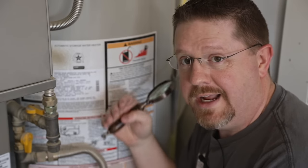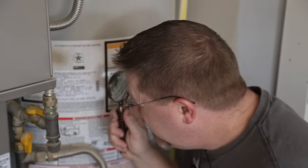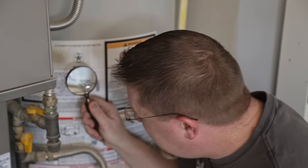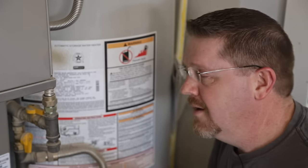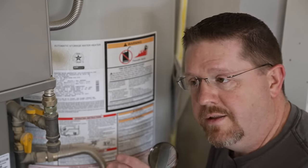There are a couple of things you might have to be a little bit of a detective about. Specifically, the model number for your heater will determine the length of your anode rod and the material it came with from the factory. If you want to replace it with an exact match, you'll need to find that model number. Mine is on this tag right here on the side of my heater. Jot that down and hit up Google — you should be able to find a parts list complete with replacement part numbers to order a new anode rod online.